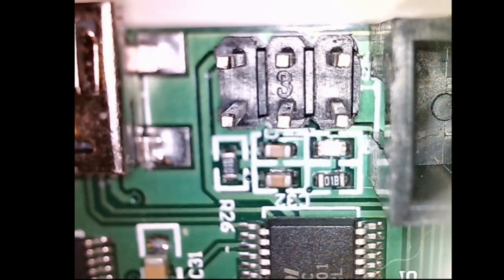There's not enough memory to put the bootloader there and put in features the marketing people say they really want, like resume on power failure and thermal runaway protection. I'm sure there's some bean counter somewhere in a factory that says the risk of a thermistor failing or a heater cartridge falling out is so small, just don't turn on thermal runaway protection. But we've seen videos of people testing this feature where the results can be catastrophic. If I'm running a printer overnight and sleeping upstairs, I don't want my printer catching fire. I elect to turn on thermal runaway protection.